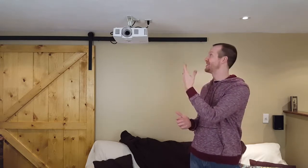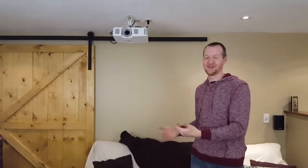Well that's today's project — pretty basic. It probably takes you less than an hour to get it mounted to the ceiling. Two main things: make sure you know the throw distance of the projector you're using — I'll provide a link to the website where you can figure that out. Also make sure you're drilling into a stud, or what I used, a sheet of plywood above the drywall. You don't want this thing to fall as you're sitting on the couch below watching TV. If you have any questions about this project just leave them below. I'll leave a link to the projector I use as well as the mount, and as always please subscribe.